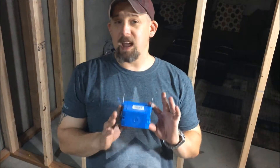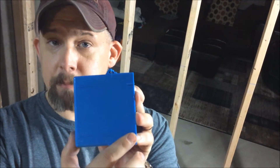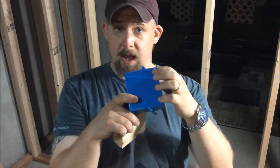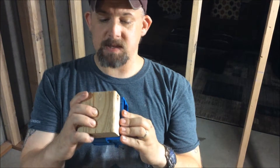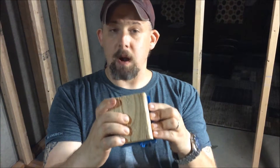Now it's time to get to the meat and potatoes of the project. These are pretty foolproof and easy to use — you just line them up with the wall. They have little tabs right there on each side. You line those tabs up with a 2x4. I've got a scrap piece of 2x4 to show you: you take the edge of the 2x4 and push the gang box in until it just makes contact with it. You can see it ends up being fairly even — use that as a guide.